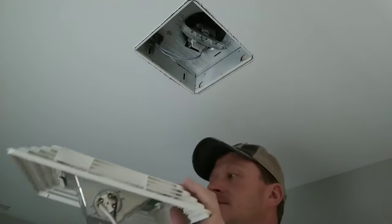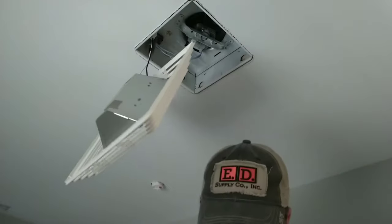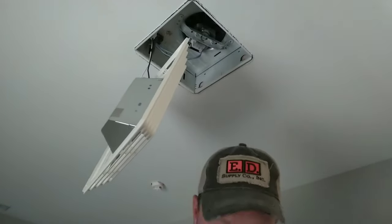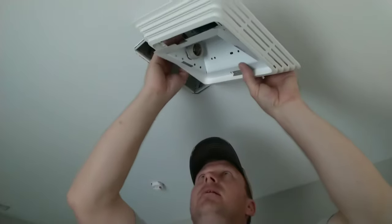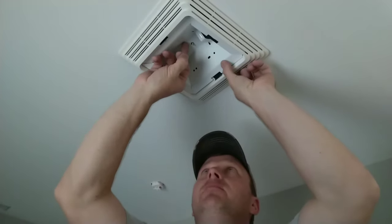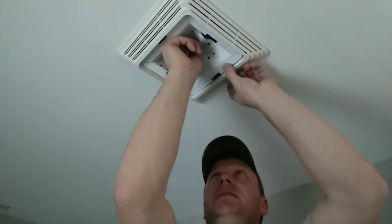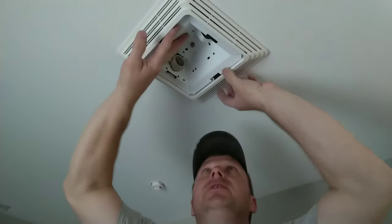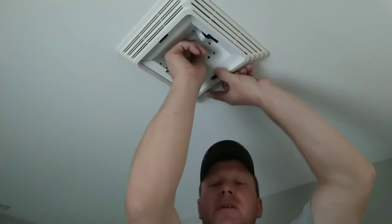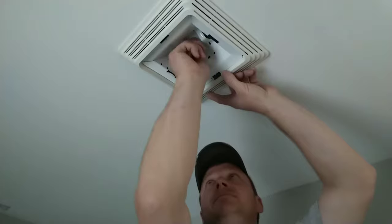Get that inserted, take this and plug it in — the plug is actually strong enough to hold it. Get your acorn cap nut, take it out of the package, push the wire up. What you're trying to do is line up the center hole with the bolt that sticks out — it's the center hole in the shield. You're going to put this acorn cap screw on it. In the past I've had these spin on me. What you can do is take the shield and with a little force push it that direction or this direction — you're pinching the bolt so you can get that acorn cap nut inserted fully into the thread and then tighten it up. Snug — you're not wrench-tightening this.